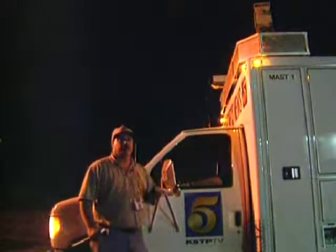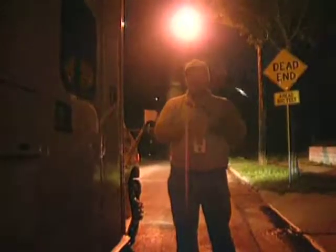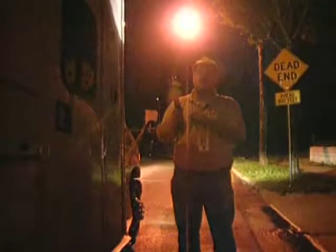I wanted to make a point, especially about night. This is shot at natural light. The best weapon you have with safety at night is, first thing you do, hop out of the truck, grab your flashlight, use your spotlight in the truck. Look at your dish, then look at your power lines. Too close, 2 to 3 truck lengths away. This is way too close. A simple flashlight or spotlight can save your life. It doesn't take much time at all.